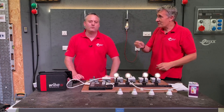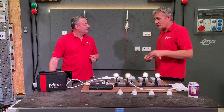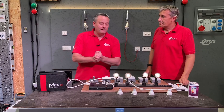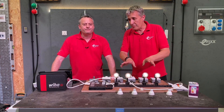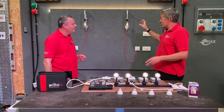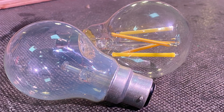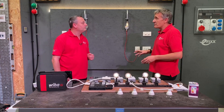There is a screw cap you can just put over that if you want to seal it off so the customer can't meddle with it. Top tip on how to remove that: a little bit of duct tape, just wipe it over the top, pull it off — it's not an issue. So we've paired this dimmer, and people asked us when we looked at GU10 lamps what dimmers are like with this very popular LED lamp style. Now I've married up some LED strip that's dimmable — I don't think we've covered that so far on the channel.